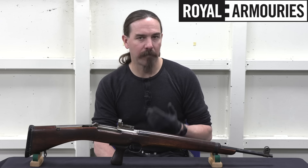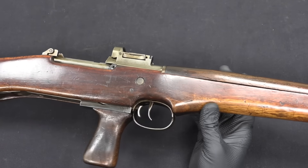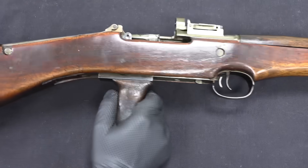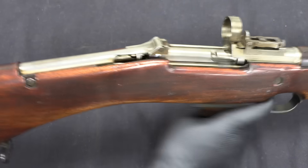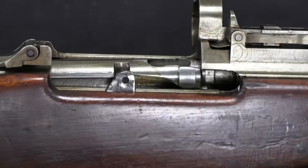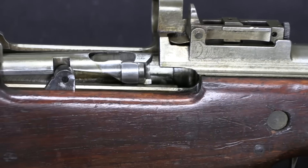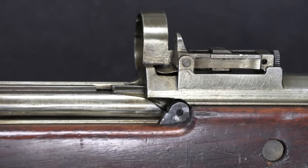We first see this documented in March of 1944. Let me show you how it actually cycles and works. Starting with the controls: the trigger is obviously the trigger, and this little button right here is the bolt handle release. You push that in and you can then pull the charging handle back. That cycles all the way back and then forward. If we look at that up top, I pull the release and it's going to cycle back like that. This is a pretty simple two-lug rotating bolt. When I push it all the way forward it's going to come up, and you can see the cam track right here. This pin is connected to the handle to cycle it forward and back. When the bolt hits the breech face it's going to stop, and that's going to force this pin down that track to lock in place.